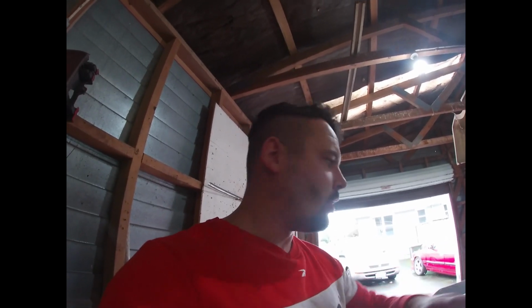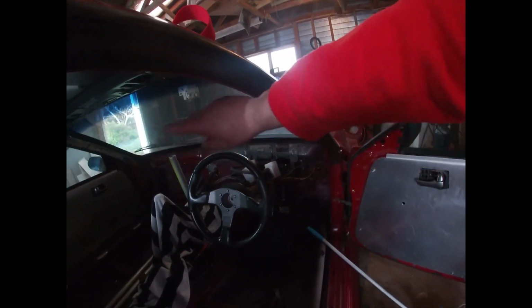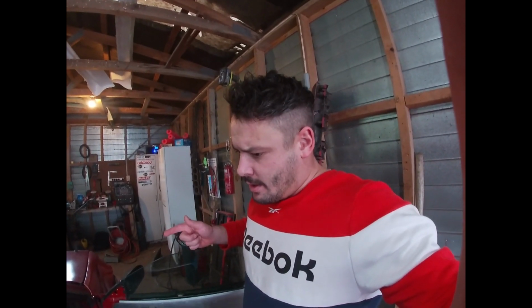Right, I just got to clean up some on the main hoop there where the old bars were welded to. Just going to clean those up with the grinder today, and then I'll sit both A-pillars in, and I'll bend up the windscreen bar, maybe just cut to length. I don't know if it needs bends in it or not. Cut that up, and the one across the bottom of the windscreen as well for the steering column to bolt to, so do that one. Then I'll tack them all in place, make sure it all looks good.